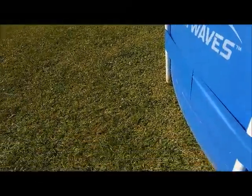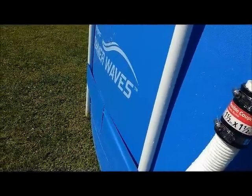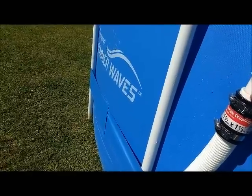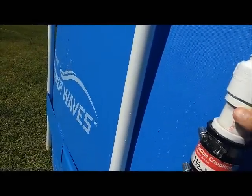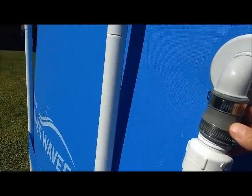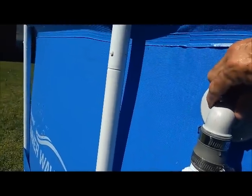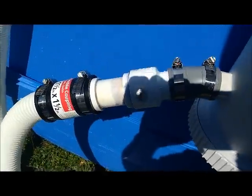What I did was I cut back the lip on there, and I got this one and a half inch by one and a half inch fitting, then I got a one and a half inch insert that goes down to one and a quarter inch so you can put pipe in there. Then I've got a one and a half inch fitting with another insert that goes down to one and a quarter inch pipe, then I've got this fitting that goes over the barbed one and a half inch and it's able to fit onto my fitting on my Polygroup Summer Waves pool.